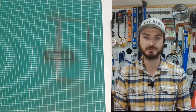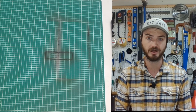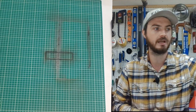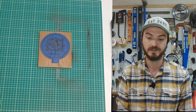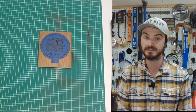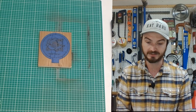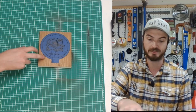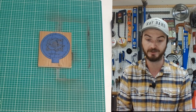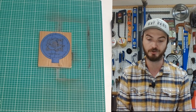After that I wanted to move on to doing a deeper engrave — almost like cutting into some thicker wood but not all the way through. We tried making another custom piece here. This one's not fully finished; I want to paint it as well. What we did was layer it with tape first, then cut through the tape and into the wood. You can get a pretty good image — it's a very clean cut. When we go to paint it, I'll just peel away the tape for the areas I want to paint first, hit it with the airbrush, let it dry, and keep removing layers as we go, painting different colors.